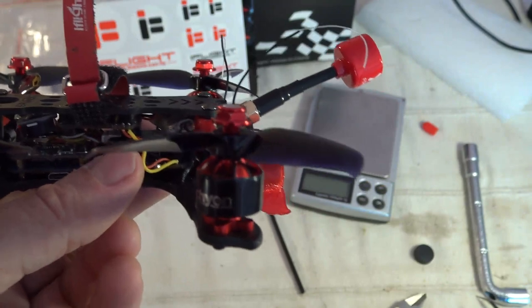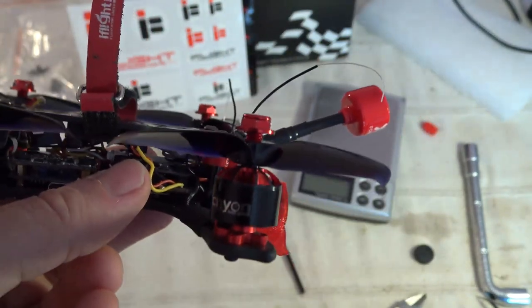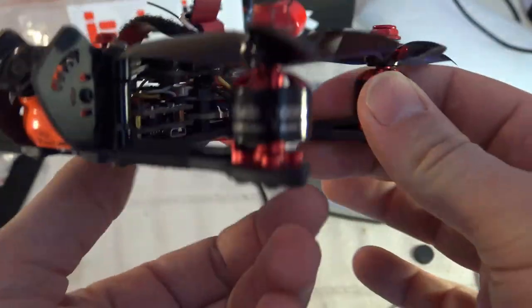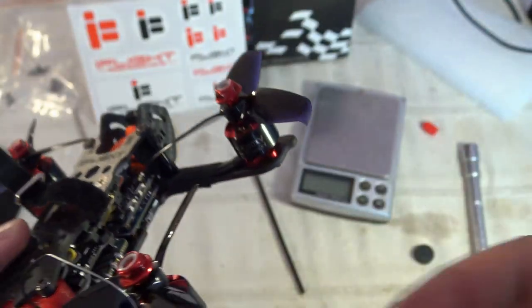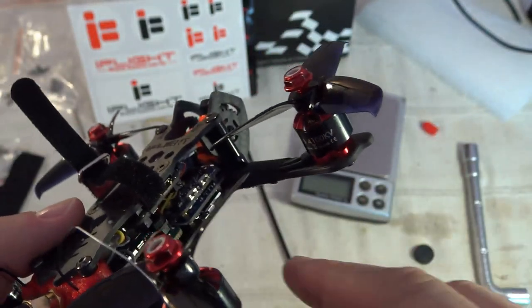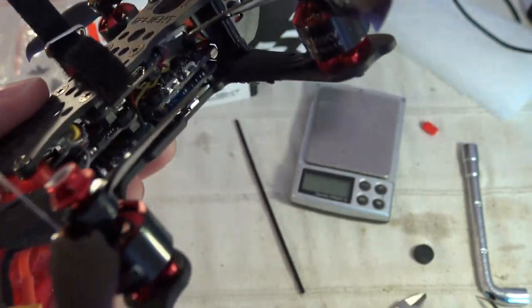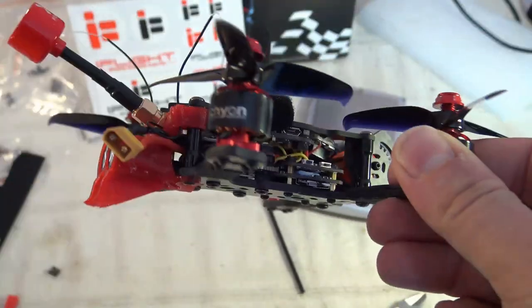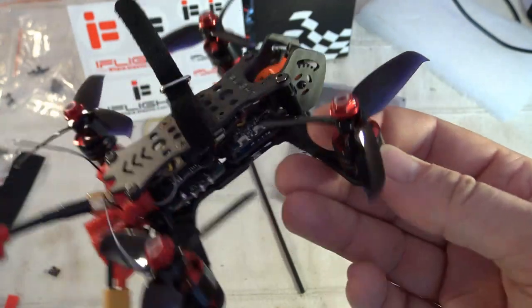What's a pity is that out of the box, due to Betaflight 3.3, it is not possible to tune everything from your OSD. And the drawback, which I would say is not really problematic, is that like the SPC Maker S125, the Runcam Split Mini is not possible to control via the OSD, which would have been a great plus. Link that with the absence of two extra UARTs on the F4 board.